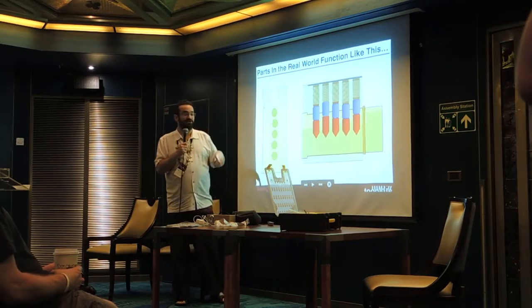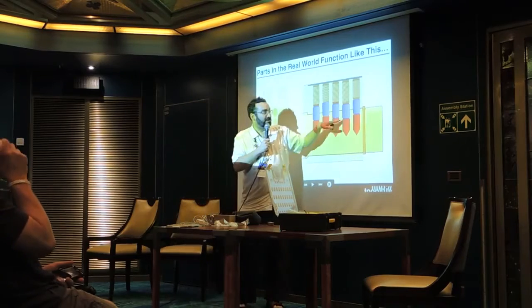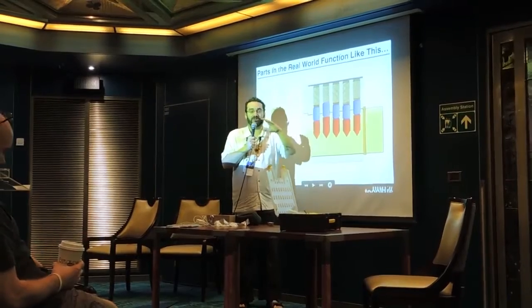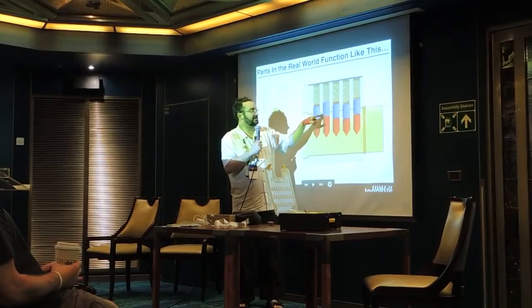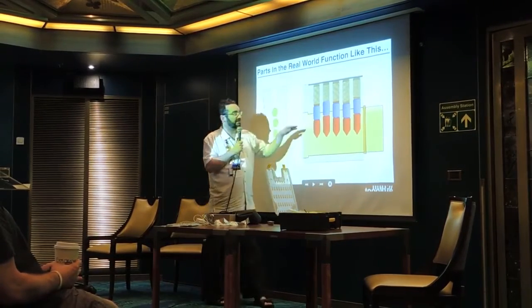And that's going to be what's called, we're going to jump ahead on the slide deck because animations don't work. So one of these drivers will actually be pushed up against first. When you try and rotate, remember I showed that slide where the driver pin was stopping the plug from rotating? Only one of these will bind first because these aren't a perfect straight line.